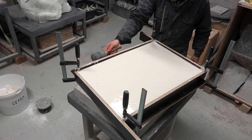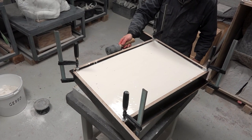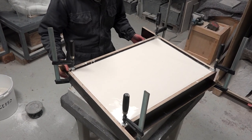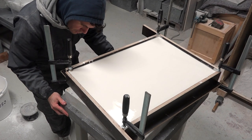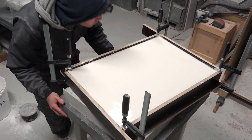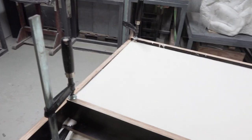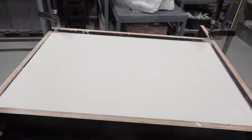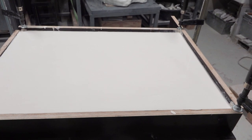And now, to get rid of all the air trapped within the thick liquid, one must tap, blow, and rock the mold a bit. The vibrations will help the air bubbles reach the surface and eventually pop. So here we have the form filled with plaster, and to make sure that it consolidates firmly I usually let it dry overnight.